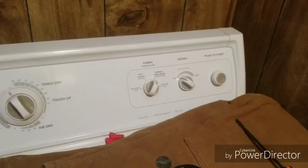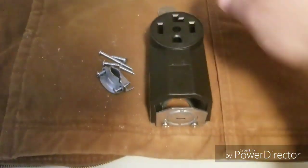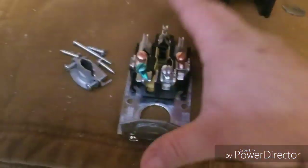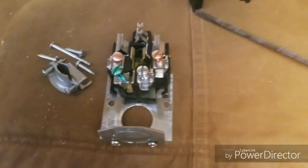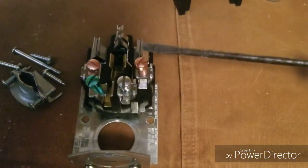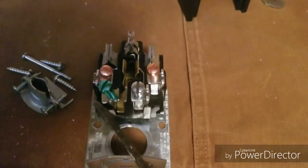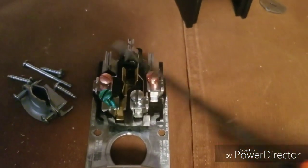Now I want to explain the plug. I do have notes — very seldomly, but I do this time. Here's the plug. Normally when you buy it, this little knockout will be in place; you knock that out and you'll have a wire crimper and some attachment hardware. You've got two copper screws, one here and one here, plus a white and a green. The way 220 works: your red and your black go to the copper screws, and you get 110 volts through each side of the plug. Your green is your ground — that's where the bare copper wire goes. The white is a neutral, kind of like a second ground, so that's where the white coated wire goes.